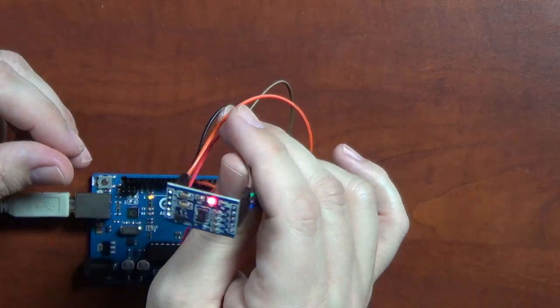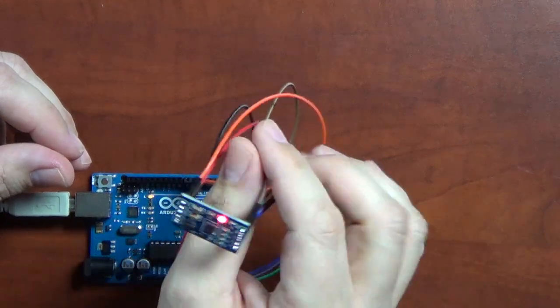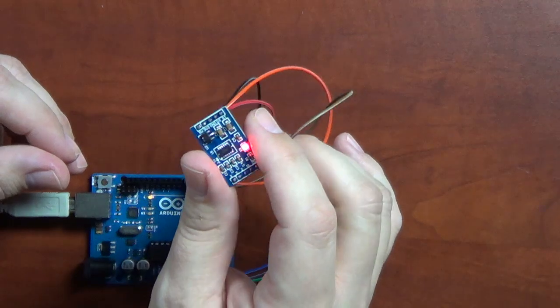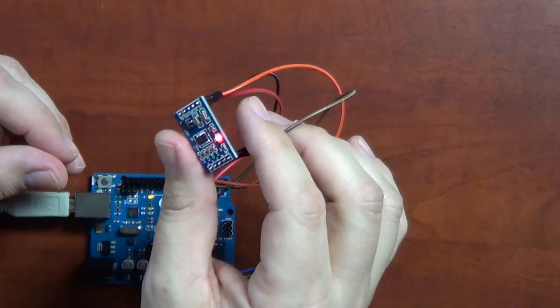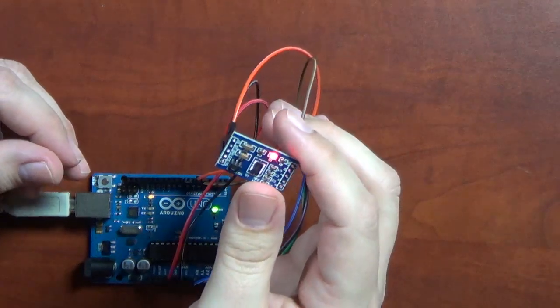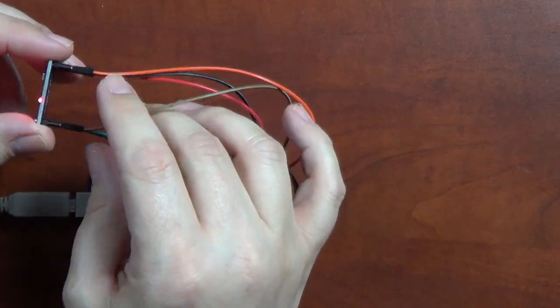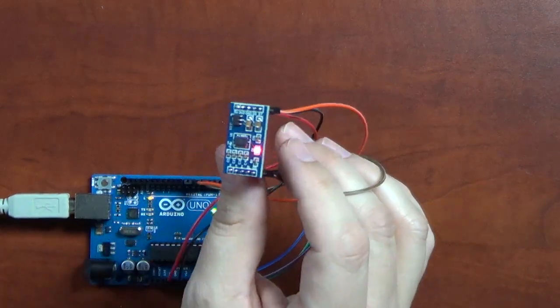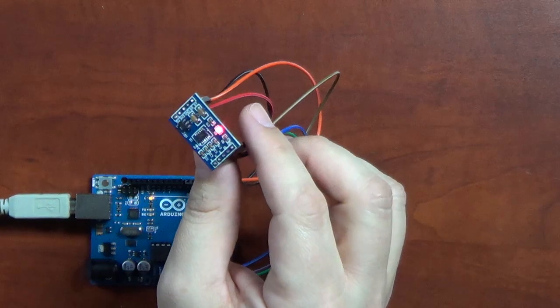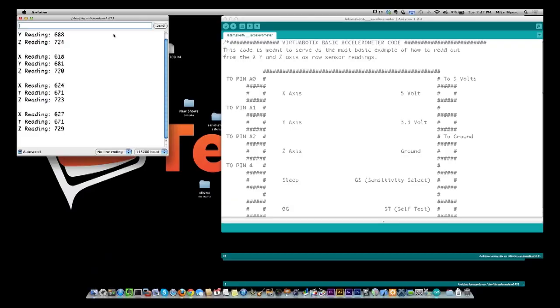So whenever this pin is low, the accelerometer will not work. So that allows you, if you have a project that uses an accelerometer, to keep turning it off and on so it's not constantly giving you data back, which helps save the battery. In my project, I've just turned it on, so I haven't gone through the whole process of writing a sleep routine for it. So let me go ahead and get this connected to our serial port. And through the magic of editing, the 30 seconds or so that it took me to get this switched over, I'm switched over to my laptop.